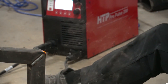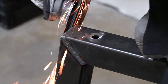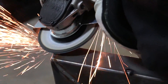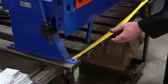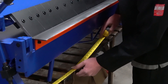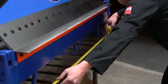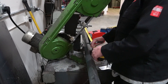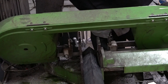That sound during the Pulse — that's just dialed. This isn't a video about the machine, I'm just kind of blown away. Either way, as soon as we get it all welded up, we're going to grind our corners down — just those outside corners — so we can lay everything flat and even. Then I'm going to go back and measure the width from bolt hole to bolt hole. This will let us figure out how much distance we need in between for our sections that will hold the two ends up. I need one on top, one on bottom — we'll throw it out of that angle iron. It's two-inch angle, eighth-inch thick. As soon as I have it all cut up, we'll get it set up and ready to put it all together.